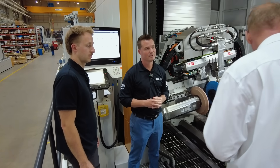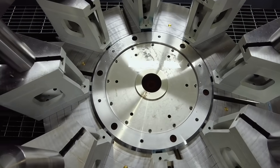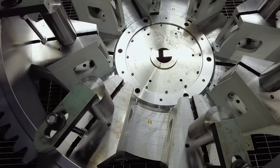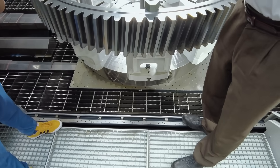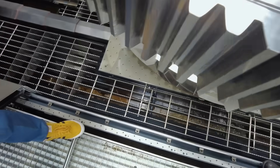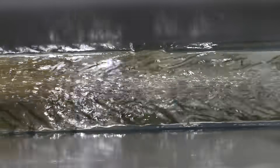Handling is important. These are very, very heavy parts here. We have a hydrostatic table, which means we can load up to 15 tons of workpiece together with fixture. That's important for the kinds of gears you might do on that machine — industrial transmission gears, wind power, energy gears. For the setup of the machine, it's also good to have circulation of oil. We have in the machine bed a circuit of oil continuously running because of thermal stability. We're talking about runouts of 20 to 30 microns on the final gear, so the machine has to stay really precise and exact.